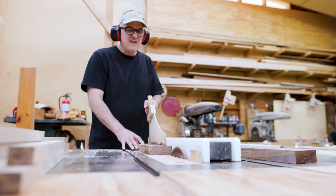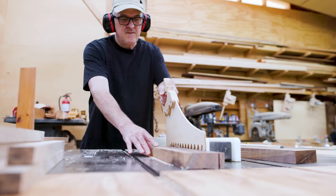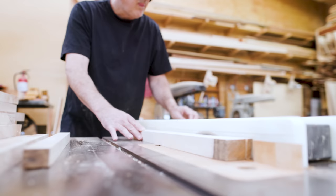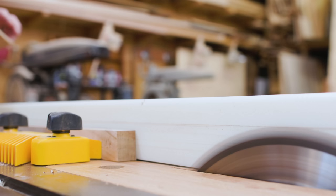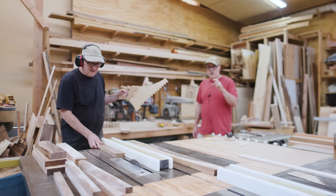Now I can finally start cutting the strips. Some of these pieces are wide enough that I can cut the strips directly from them and get the width of the triangle I want from the width of the piece of wood. But some of them couldn't be made that thick, so they're a little too thin. For those, I'll cut the width of the triangle into a stick and then cut my strips from that piece — so it'll be rotated within the piece of wood. I probably won't get quite as much material out of those pieces, but I'll get something.